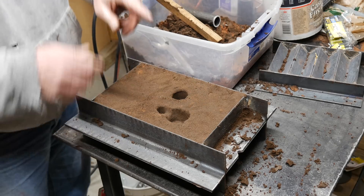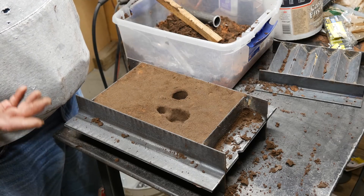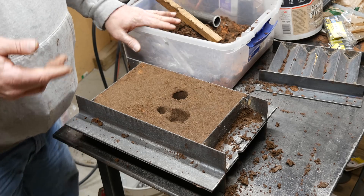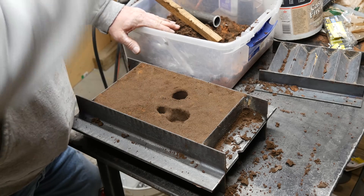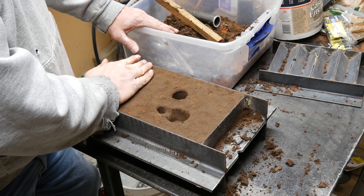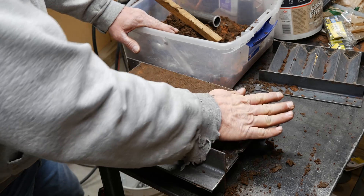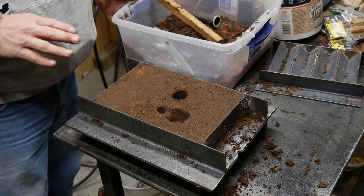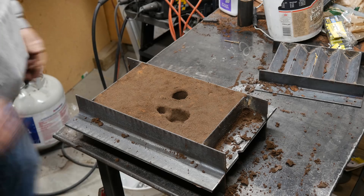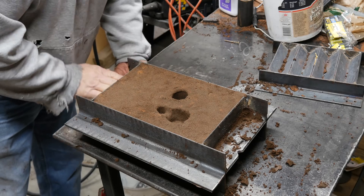Now the hard part is cutting this ridge. As I learned on a pour that you never saw, the ridge has got to be lower than this surface - otherwise the metal just fills up here and runs all over the back of your mold. It's supposed to be just a nice gradual sort of pour over, not a boom like a waterfall, but just a nice gentle slope into the sprue. It should be smooth going in there - no corners for it to have to go around. The idea, I think, is to reduce turbulence so you don't get a bunch of air coming down. You fill it up here and it runs over. I don't quite understand the science of it, but it seems better than just pouring straight down into the mold, which I know a lot of guys do.